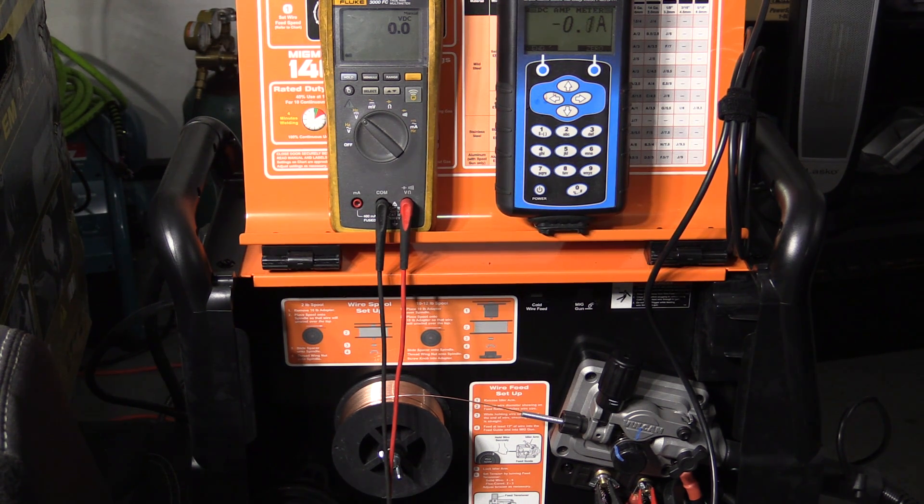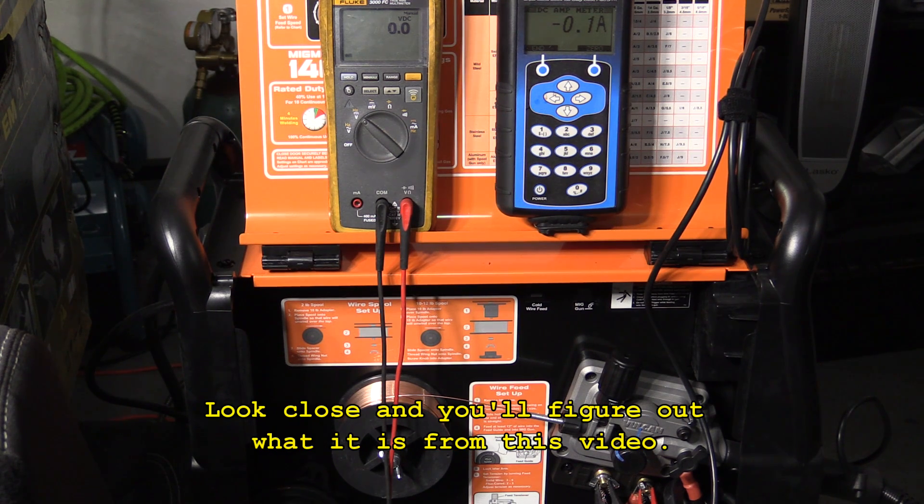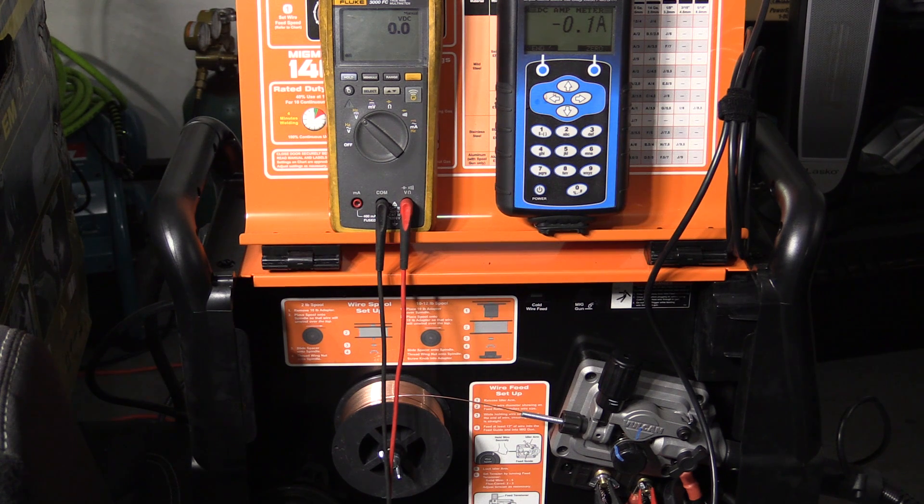I do have another dual voltage machine I'm going to take a look at. I was going to do a comparison in this video but after seeing those results it's pretty clear what's going on with this machine — plenty capable of the output, just a little bit low on wire feed speed. I'll do a full review of the other machine and show all those results there. So the basics: not an underpowered welder, but a bit limited on wire feed speed — if you want the power you're going to need to run 035 wire. Hope you learned something. If you have any questions post them below. Thanks for watching, take care.